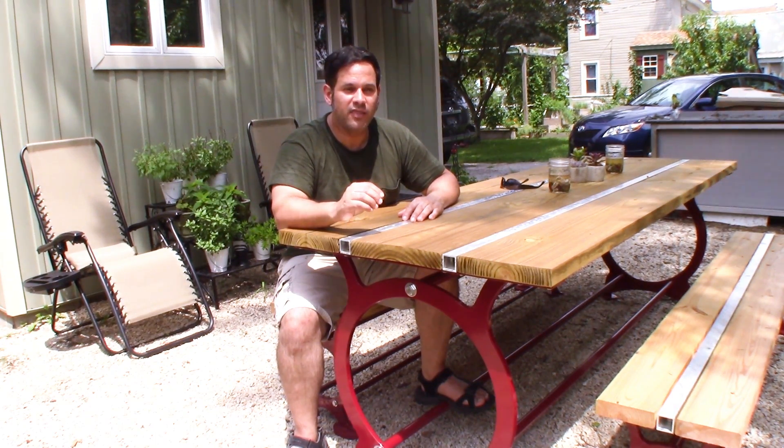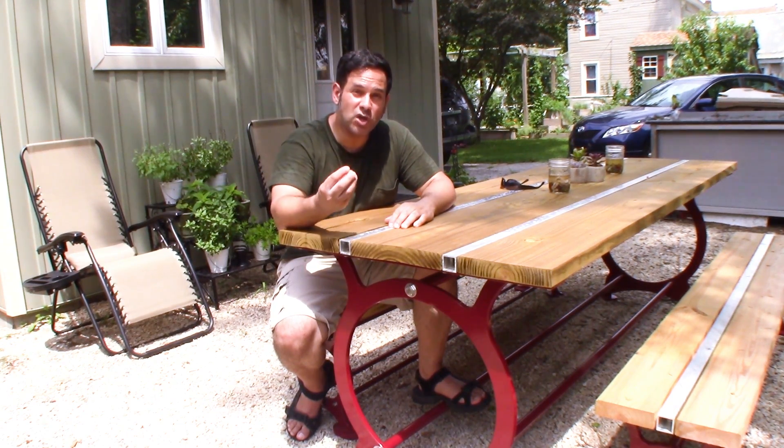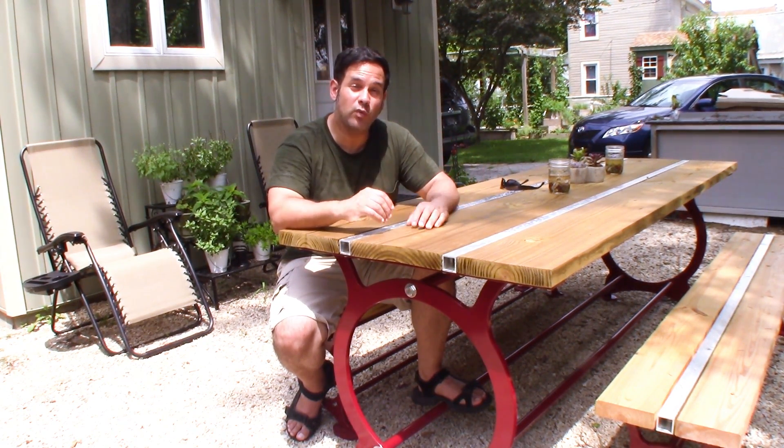The second scene I did show, but in a compressed form, and I feel like because I didn't include the explanation, some of the intricacies and subtleties were missed — and that was the repair of the bench spreaders. Those half-inch pipes where I had to drill it, tap it, and put in these small adapters. Those adapters are actually bought — they are like helicoils, but they're solid threaded inserts. Let me show you that video scene so you can get the full grasp of how much work it was to actually repair those pipes in order to get the finished result we wanted with the three-eighths bolts.